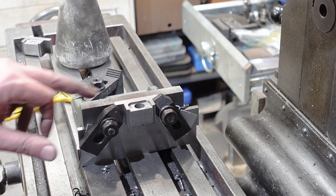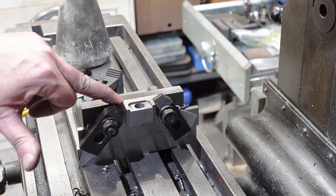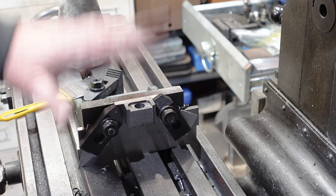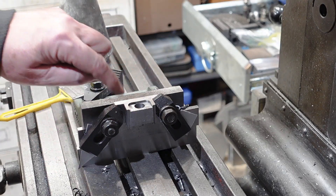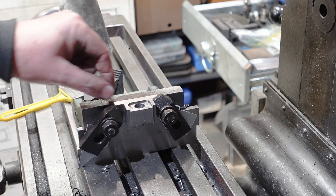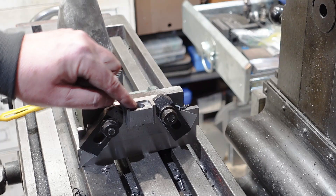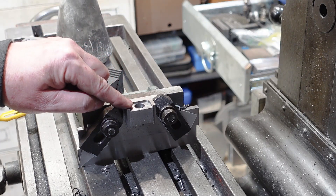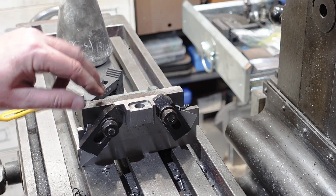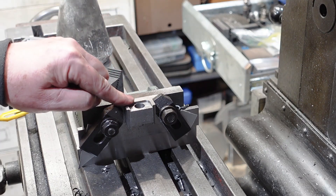This is the setup I'm using to drill my holes and try to get them as perpendicular to the surface as I can. I've got an angle plate here, a couple of parallels on there, and that's been tapped down well. I've measured off and centralised, so I've got a hole that's seven and a half down from that surface. I'm not quite sure how well that's going to work because it's an M14 hole, but it looks mighty close. I've got to trust my DRO sometime. I've got one done, the other one to do, and then I've got to put a right hand thread in one and a left hand thread in the other.